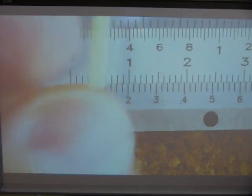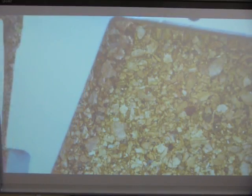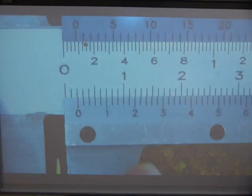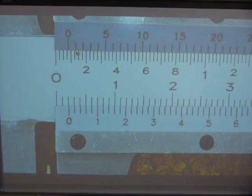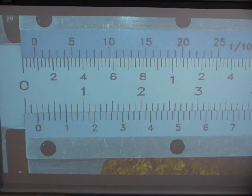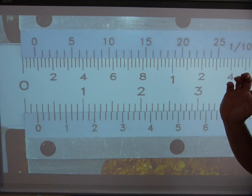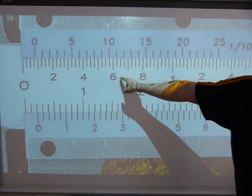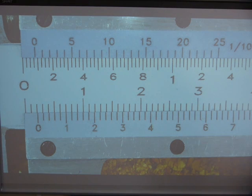Let's measure the thickness of this toothpick — I'll show you how these numbers are generated. The whole number digits come off the main scale. You can see the numbers 0, 2, 4, 6, 8, 1 — that's one inch. The thickness of the toothpick is not more than one inch, so it's going to be zero point something. The whole number of inches is zero because we are under an inch.